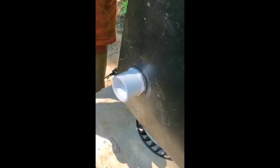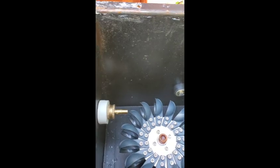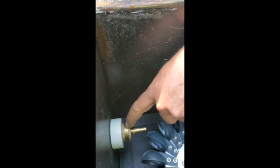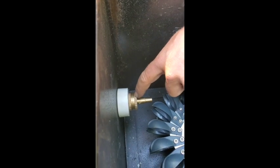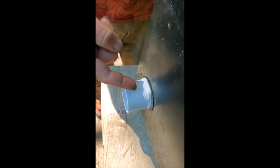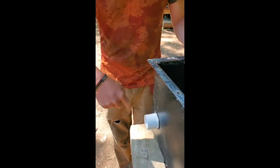With this assembly, we're at the correct distance from the little spoons on the Pelton wheel. The gasket is engaged on the nozzle so there should be no leaking inside. Once we thread tape and pipe dope it, there's a gasket between the bushing and housing on this side so no water can get behind. If any does, there's another gasket on the outside to prevent water from spilling out. Then we tighten this as tight as we can, and this is where the T will enter to begin the whole outside. I think we did it.